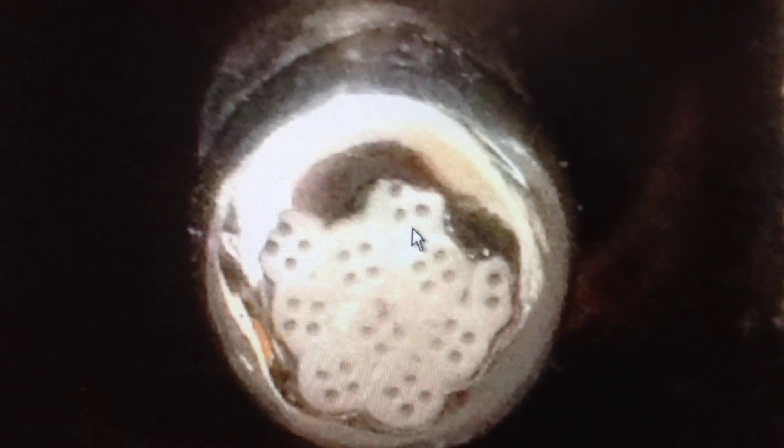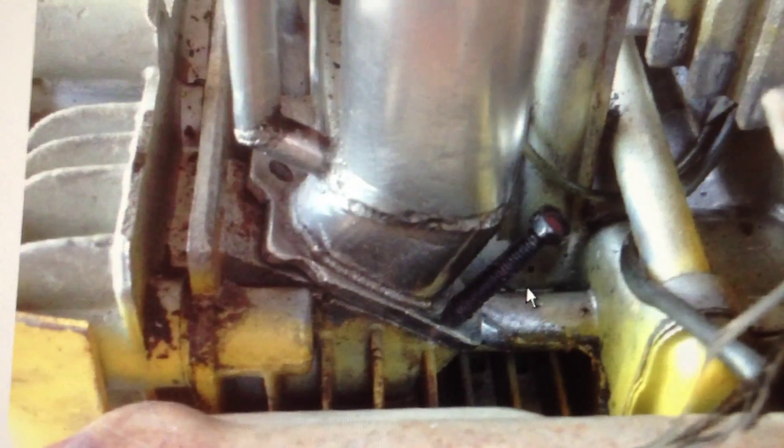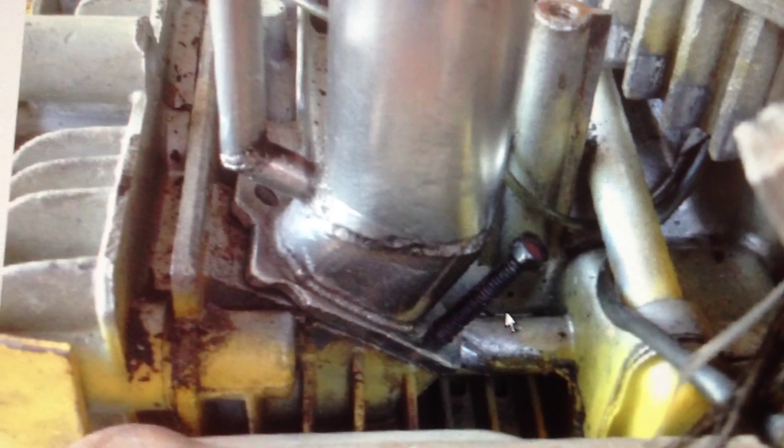So as it is, it's pretty good now. Because that's bonded to the inside tube with the investment material, the only way to get that off now really is to force it off, because the bonding material is good to over 2000 degrees Celsius — and the housing would melt before that. Anyway, that's where I am so far. I'll keep you posted. Post your thoughts. Bye for now.